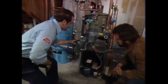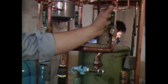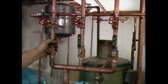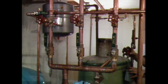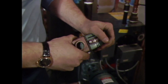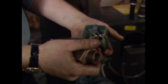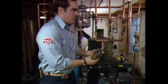This is a hot water system with a circulating pump that sends the heated water through three separate zones: one zone for our new living spaces, one for our sleep areas, and one for our basement zone — the future rumpus room. If we've got three zones, how come we don't need three different pumps? What we've done is use one pump and three separate zone valves to control those three areas. When the thermostat calls for heat, it drives a piston down to open the valve, allowing water to circulate through the baseboard, and also brings on the circulator and burner.